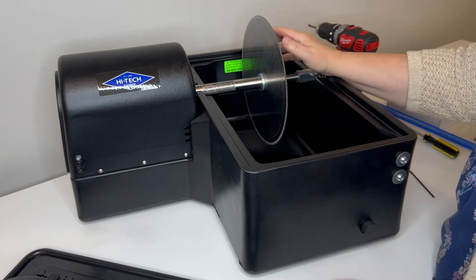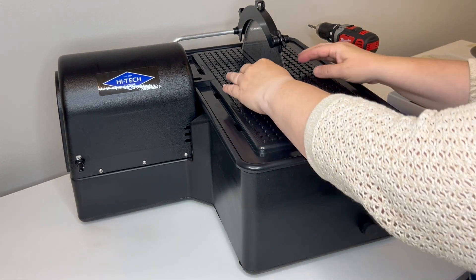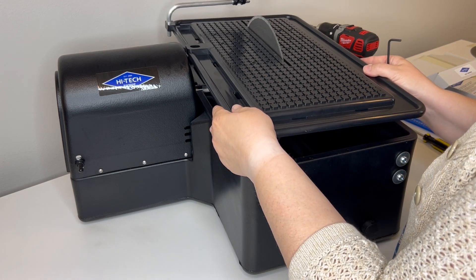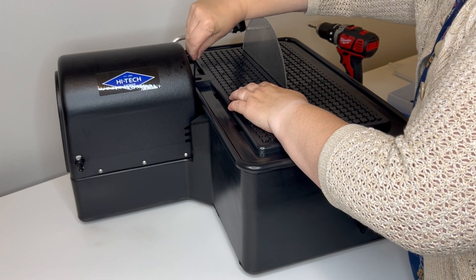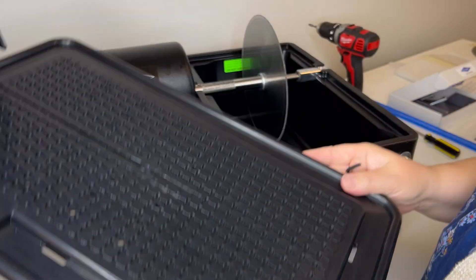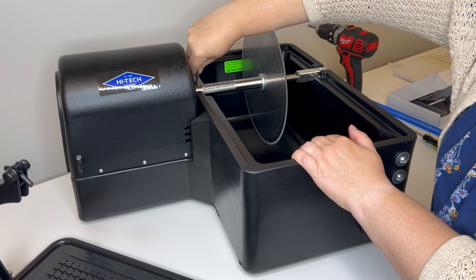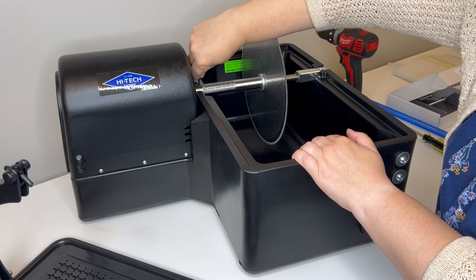I can move it back and forth, so I know I need to move it a little to the left. I'll check the adjustment — that looks pretty good, just moving it a hair to the right. There is an access hole on the right-hand side, and with the set screws facing up you can reach in and tighten them without removing the blade. I'm using the short end of the Allen wrench for more power. It's really important that these are very tight onto the flat of the motor shaft.